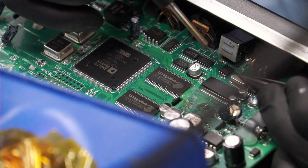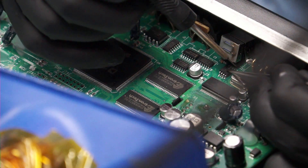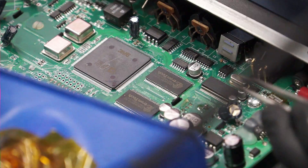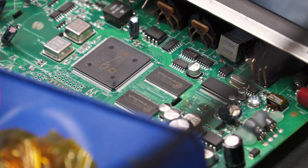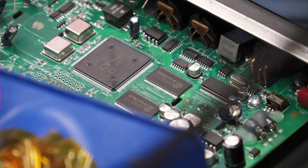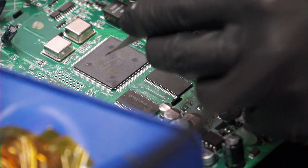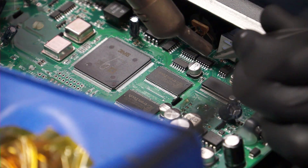I'm pushing this down against the board and making sure that the solder is going on each leg. I'm gonna have to use a little bit of hot air to flow this into place, but I'm not gonna put the air really high. This is also a single or double layer PC board — look at the processes on this thing, it looks like it's from 1982. So I shouldn't have to worry too much.